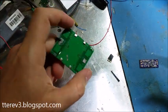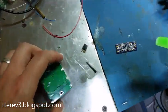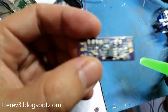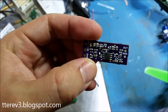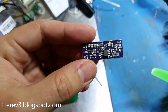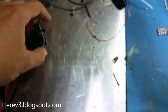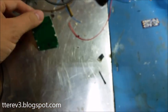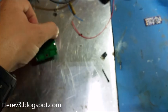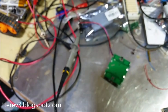My boards came in to work with the radar module. This is an HB100 radar module, and I got my boards in from OSH Park — that is an amplifier and bandpass filter for the very low level signal that comes out of that radar module. What comes out of it is a Doppler frequency, which is the difference between the frequency coming back and the 10 GHz that the radar spits out.